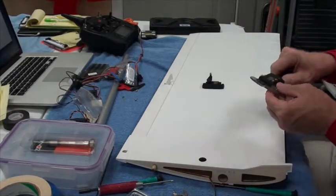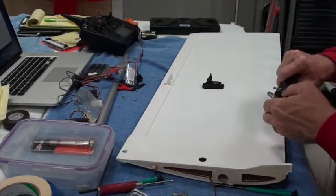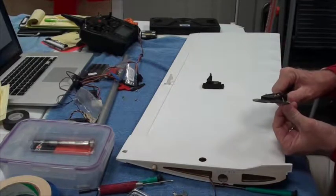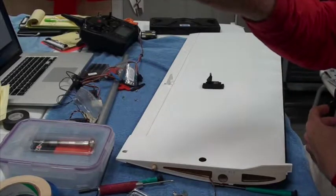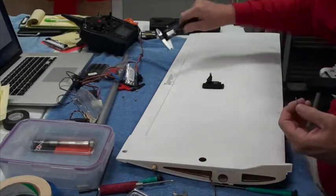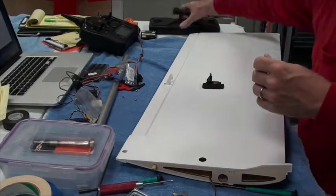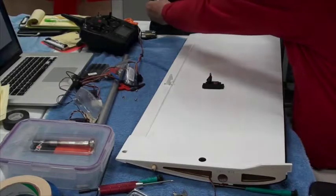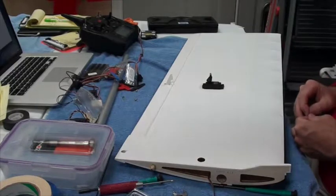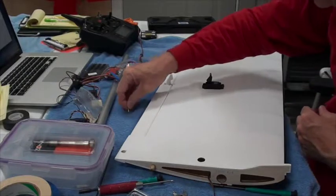That is 2.09 in millimeters. By the way, if you must know, like I must know, in fractions of an inch, that is a 5/64 size diameter screw. So 5/64. Turn the caliper off. Put it back in this little home. So 5/64 is the diameter of that, and we don't want to eat into it too much.